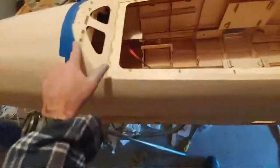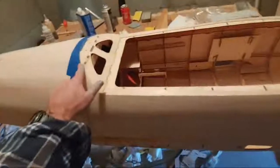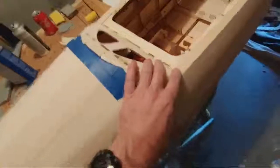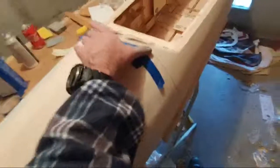And then, of course, I put guide pins in here. My guide pins are just 2 dowels that I put in, and I used a couple spare washers from the center kit to do it. Guys asked me, did you forget to put in some pieces? No, I didn't. One thing I want to explain to you guys. I could have beefed this up and made this twice as thick, and I could have remanufactured all this, but it was not necessary.